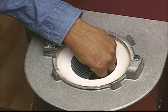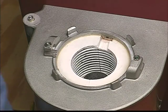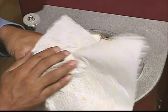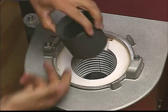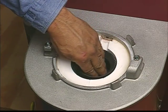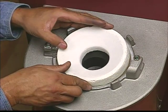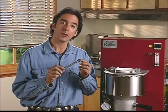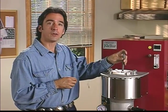To assemble the crucible parts, first place the ceramic crucible stand on the melting chamber floor with the funnel protrusion down so the flat side faces up. Next, put the black lower crucible gasket on top of the crucible stand. Be sure it fits down inside of the crucible stand rim. Do not leave this part out. This gasket helps protect the crucible from deterioration and must be replaced when it begins to lose its black color. Wipe the crucible with a paper towel inside and out and check the pour hole to be sure there are no imperfections or obstructions. Set the crucible on the gasket in the chamber and check for centering. Place the large ceramic filling cone disc over the top of the crucible. If this were a maintenance replacement, you'd want to check this sealing rod ball for wear and replace it if necessary. This ball must fit properly in the bottom of the crucible in order to maintain a good seal. An imperfection in the fit will allow liquid metal to escape.